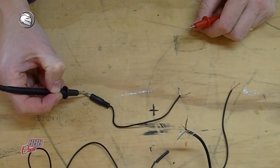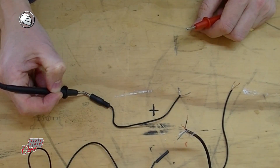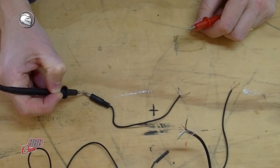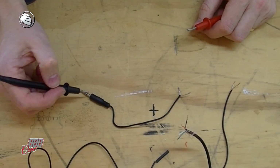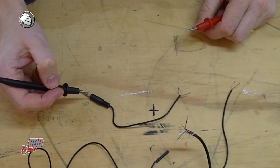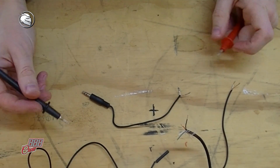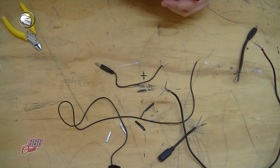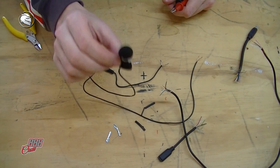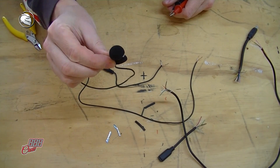All this is allowing for is a camera or an audio input that will accept a stereo connection. In other words, a separated left and right channel from ground. If it's a mono connection, in other words, if this plug only had two segments, the ground and then the tip, then all that would happen is it would only feed either the left or the right audio channel of your camera. And then you'd have to combine it in post. So I hope that clears that up. A true stereo microphone doesn't necessarily have to have two microphones, but if you were talking about recording separate left and right audio channels, you would need two of these, one for each channel, okay?